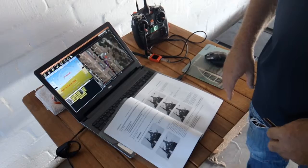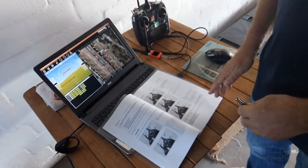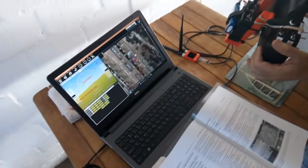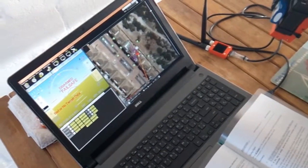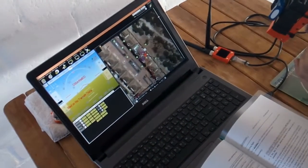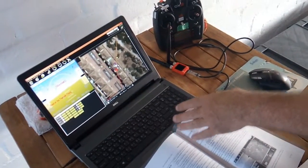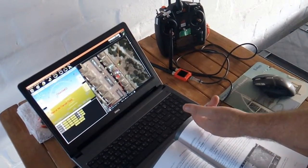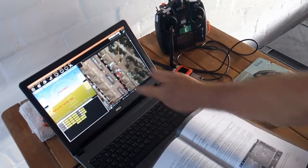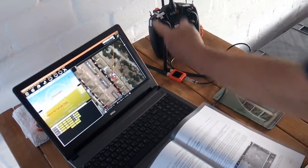So I'm still thinking to do a calibration, just going and recording the checklist. Okay, unplug. Disarmed, fail safe, and then plug back in again. And all back to normal. When I unplug, fail safe, I was too quick to put the plug back, but the plane switched to RTL, so yes, it's confirmed, it will go to RTL. And I had to just cancel it.